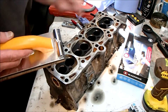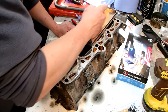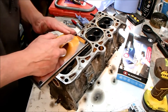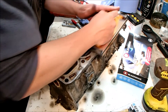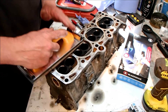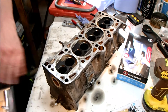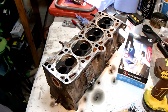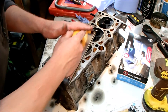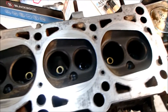I've used the razor blade to remove all the rough stuff. I've now got 600 grit — starting fine just to see what the effect is. I don't want to go too coarse. On this sanding block I'm trying to keep it as flat as possible. I don't think 600 grit at this level is going to do a lot of damage, but the idea is to see if I can just clean it up enough with this. If not I might drop down to 400. I'm just worried I don't want to sand out the centres too much. I'm just being cautious. Worst case scenario a skim will be necessary to get it flat again. Not very much work — just enough to clean the surface of deposits.